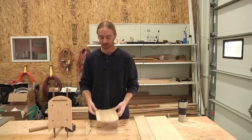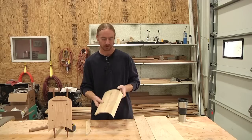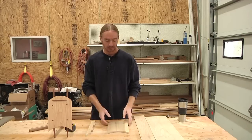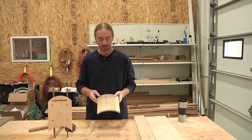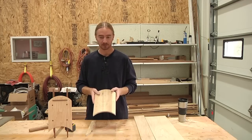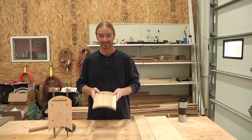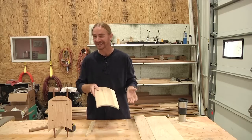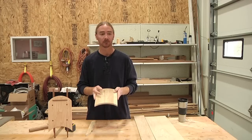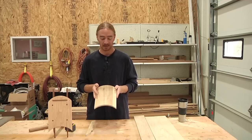The dimensions for the main top are roughly ten and a half inches long and six and three quarters inches wide. For both pieces I'm using half-inch stock. Now for the top specifically, if you don't have a solid piece of wood that's this wide, take some strips and glue it up — it'll look really sharp. If you've got some neat woods laying around, little scraps you've been saving, you can take a bunch of little strips, glue them up, and it'll look very unique. People will love it.